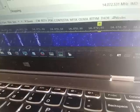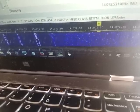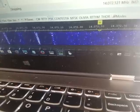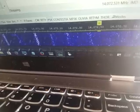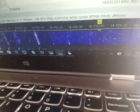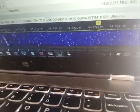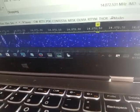I tried it and made a few contacts, but every single time the person on the other side told me I'm off by a few hertz. Luckily, they have a waterfall view and can detect that my signal is slightly off the channel where I need to be. But if you're not in that situation, then unless it's a really strong signal, chances are you will be slightly off. So that's one of the drawbacks of using the internal reader, and the same goes for the terminal view you can get into the KX2 utility.